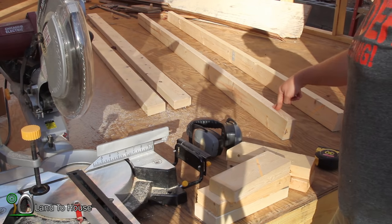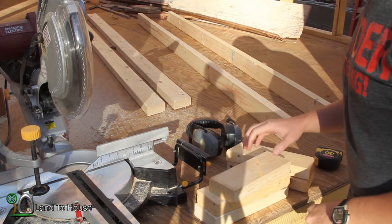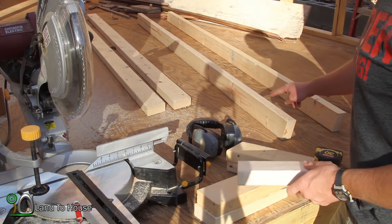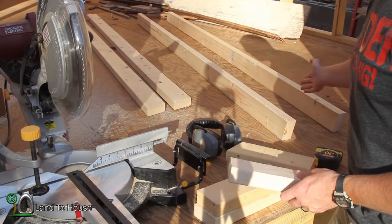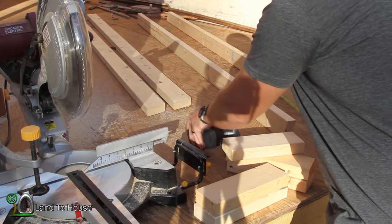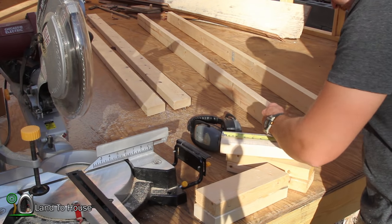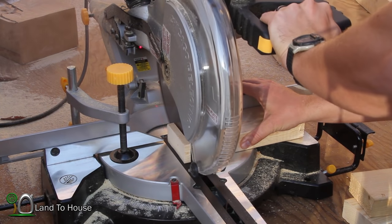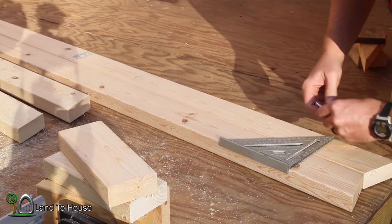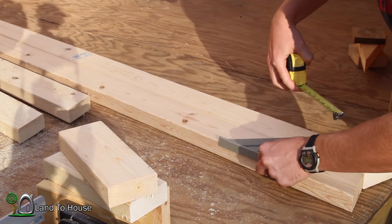I have all four of these boards cut, so now I need to get the boards that will go between here to actually make up the ladder. Because I only have a foot up top, I need to have these boards cut to 9 inches, because these two boards will make up 3 inches together. I'm going to measure out these boards and mark at 9. In order to get all of these middle boards onto the ladder sides properly, I'm going to use a speed square and just mark across, then come down an inch and a half.